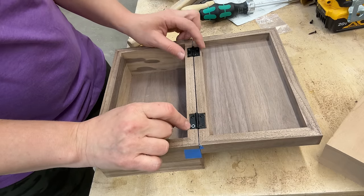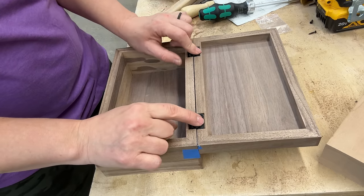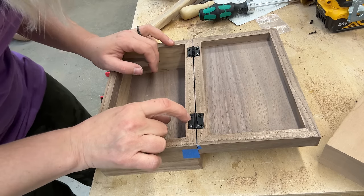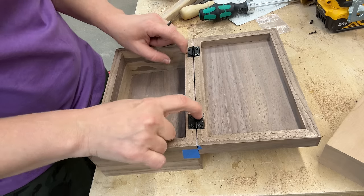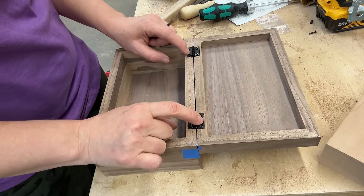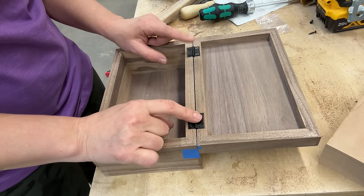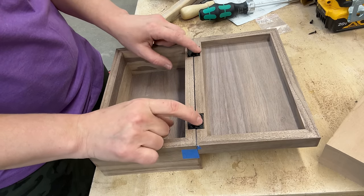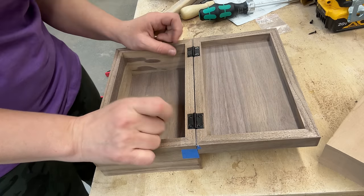What to do? I feel like the only thing to do is pull out the screws, fill in those holes with a toothpick and super glue — not all the holes, just the problematic ones — then drill them again and reattach the hinges. I'm going to do this off camera and then come back.